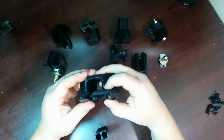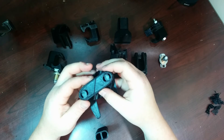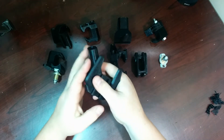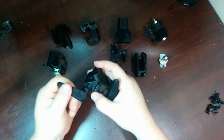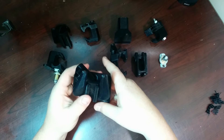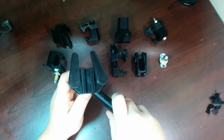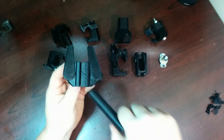To try to eliminate the bending moment, I printed these four pieces. This one has been cut post-process to understand more of what was happening. But this gave me a lot of strength. The only problem was it's four pieces — kind of thick and bulky. But it was the same idea: that would slide in, this would lock down, and that would lock up. I also learned that you did not have to print the rail perfectly vertical on the posts — you can actually print it at an angle and still get the same strength.